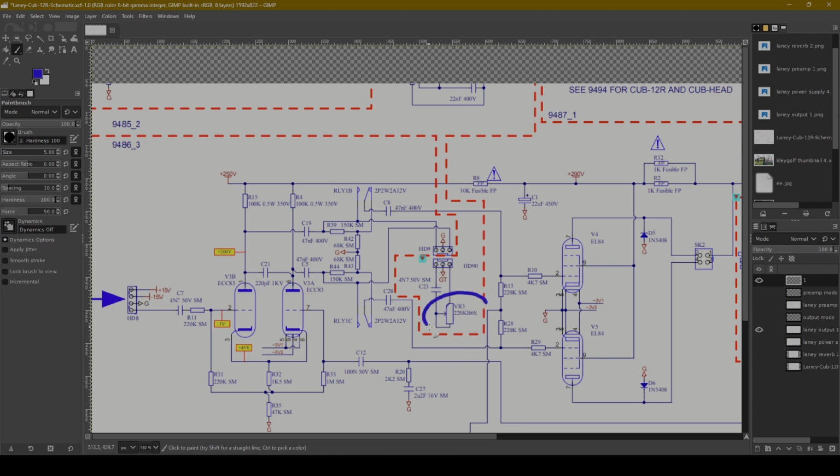So one thing you could potentially do is try to find this VR3. I don't know if this is like a trim pot in the amp, but you could put this on an actual 250K linear pot and stick it on the chassis of the amp. And then you could have total control over, when you're in the 1 watt mode, this master volume. And you could even use an AB switch on the front end to go between the two to give you varying levels of post-phase inverter master volume. That would be kind of interesting.